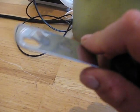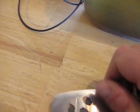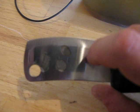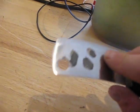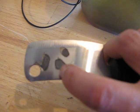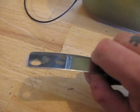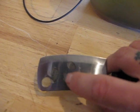If you look at the thickness of this knife blade it's very thin, so I was actually worried about etching all the way through it — I could have left it a little longer. On a thicker knife blade you could get as deep as you like; just leave it in the solution longer. You do have to be extremely careful about the stencil, but if you get a good stencil it's pretty much a foolproof process. The etched surface has a rough, sandpapery texture where the metal has been removed.